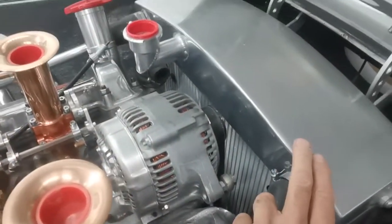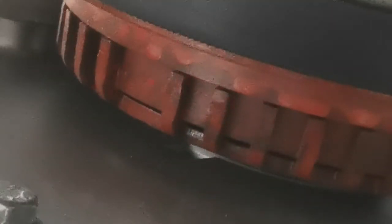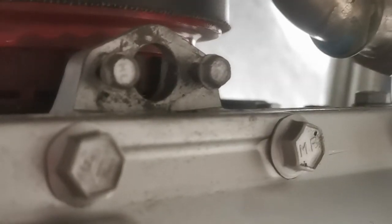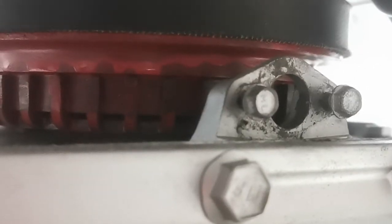This is a standard Ronart radiator that they provide. Looking from down below, I can zoom in onto the trigger wheel, which I made up by hand. There's the trigger wheel and there's a section of it cut out — a minus-one increment on there. As that revolves, it will trigger the Emerald system to fire up on the various banks on the ignition side. There you can see where the trigger sensor goes on, which is on the original HE engine, and that will match up to the underside of the trigger wheel, sorting out all the timing on the V12 HE power plant.